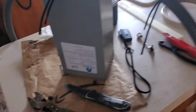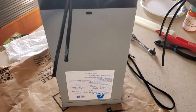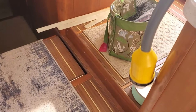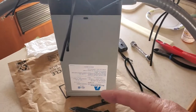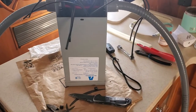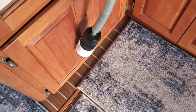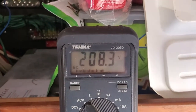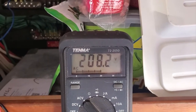I bought a buck-boost transformer. I'm going to connect this before the pedestal — the pedestal is going to come into that plug, go through this transformer. It's got windings in here and it's going to boost it — should boost it 32 volts. So 208 should become 240. Then it should be 240 coming out of there back into the boat. Instead of reading 208, where I only get half on each leg at 104 volts, I should have 240 when I put this in.